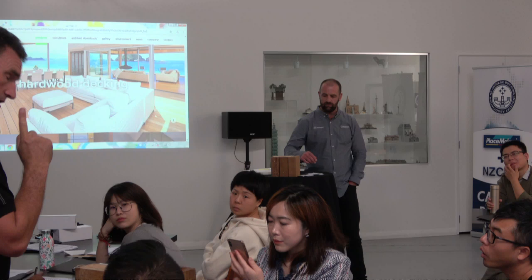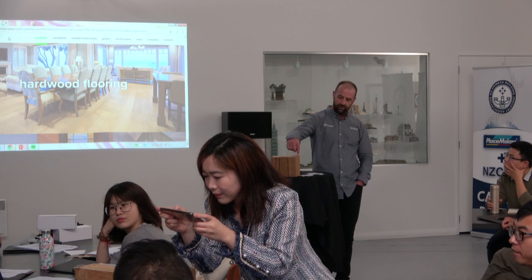Only one nail. So from the corner, from the lap detail, 30 to 35 millimetres. Not centre. Not centre. 30 to 35, from one side, from this lap. Yep, so 30 to 35. And that's for every board: X100, X150, X200.